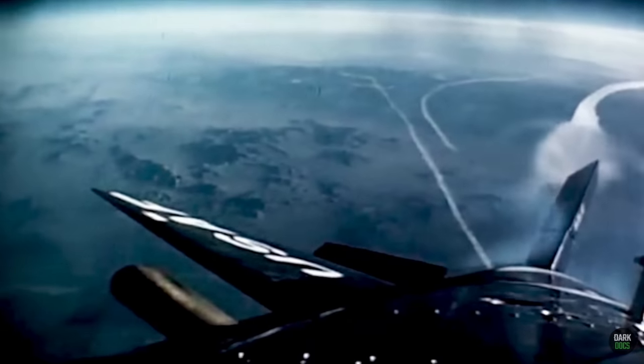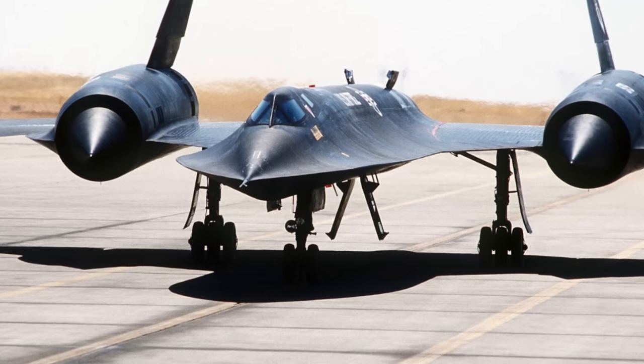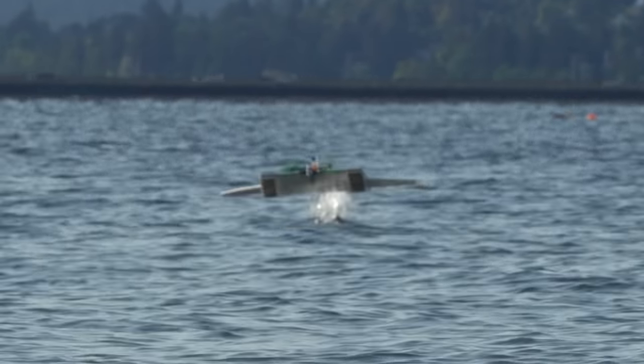A foil needs to be able to work at varying angles of attack. In the front of an airfoil's leading edge, there is a stagnation point right where the air splits. This stagnation point stays perfectly aligned with the oncoming air even when the angle of attack changes. With a sharp leading edge, there is no stagnation point that changes with angle of attack, so if the wing is at any non-zero angle of attack, the air is forced to make a sharp direction change, which causes drag. At extreme angles you also get flow separation on the top of the leading edge. This is all only true about subsonic flight — at supersonic speeds, sharp leading edges are actually good.